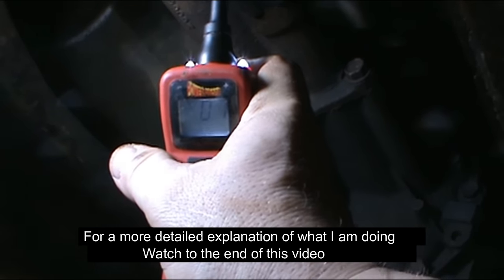If you've got a four-wheel drive problem, it will cost you like two minutes to go ahead and vampire-connect that wire and throw it on anyway just to see if that works — it will cost you almost nothing. If you did all those tests and you think your motor might be bad, I'll link my video on how I took that motor out and also a cheaper fix than replacing the whole motor, unless you've got broken damaged wires or something broke with the case. That's my story — we're out.